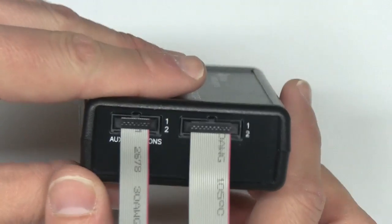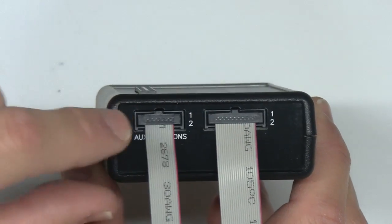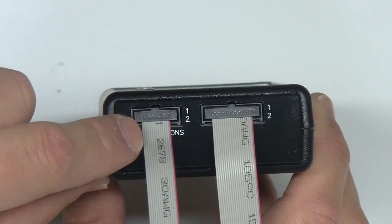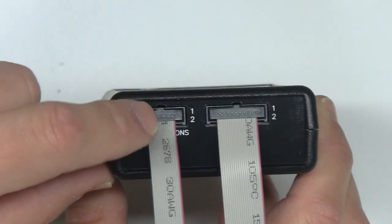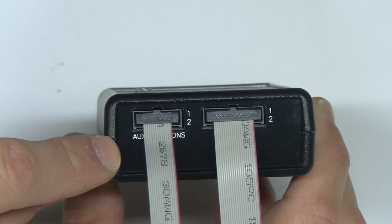This is the part where you have the auxiliary cable and the debug cable. The auxiliary cable performs functions not only for energy trace, but also for UART — it has a UART in it — and also some GPIOs. So you can control things on your target directly from the pod.